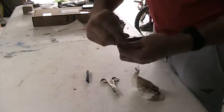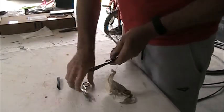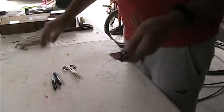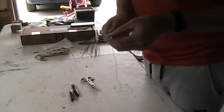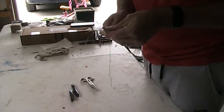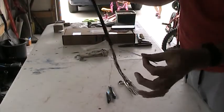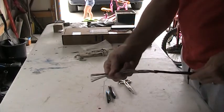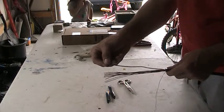Right? And then you grab your conductors, you pull them out of the plastic like that, snip that off. I usually leave this intact until I know that I'm done for sure. But now you've got the right length of conductor in order to do whatever you need to do. So in this particular case, this could be going into your NID, in which case this attaches to your block, which is where you connect your inside wire to, or this could be going into the terminal where you will splice onto the incoming pairs.